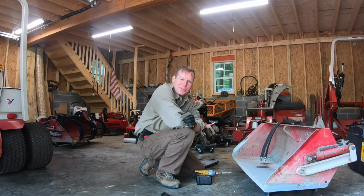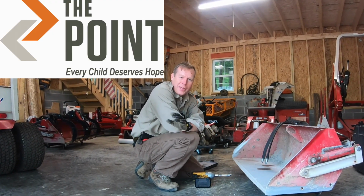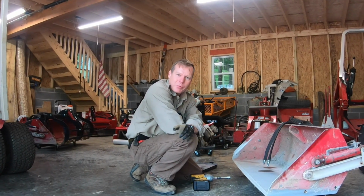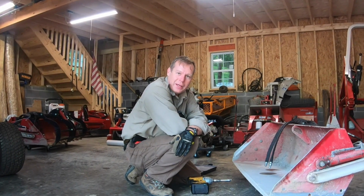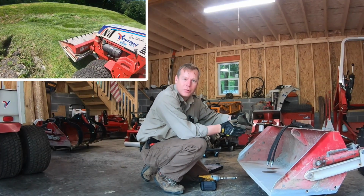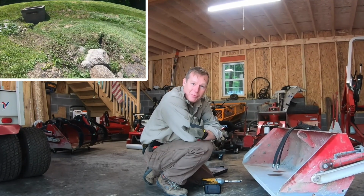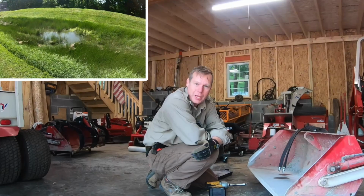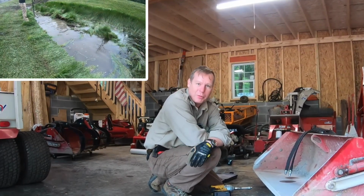Hey everybody, thanks for joining us again today. We do work for a local youth ministry and we're excited every chance we get to go over there and help them out. This particular one, they have a retention pond and it's filled up with silt over the years, and we're going to clean that out. There's a section right now that is holding a lot of water. Luckily, it is uphill from the drain area. So we're going to cut a relief trench in there, allow that to drain, and possibly go back at another point in the future and grade the whole thing.